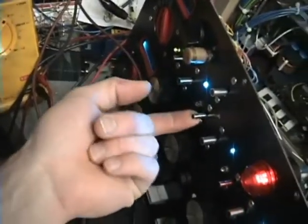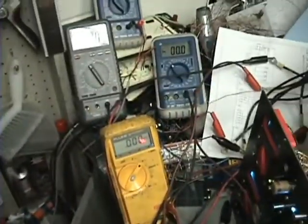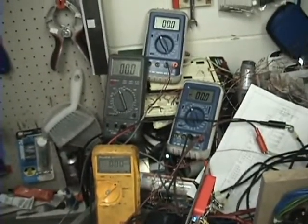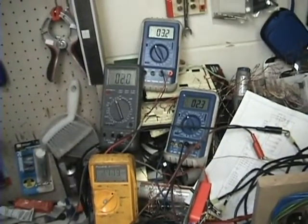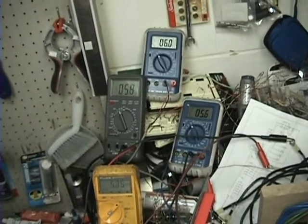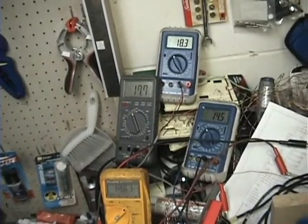Now, remember I told you these switches here connect these together. So now this knob runs all these. Without these, basically they do nothing. No voltage changes, as you can see. So I'm just going to use this one knob, and you can watch what happens to these voltages. They'll all go up at close to the same rate. Again, I'm doing that with one knob because I've internally tied these power supplies, just the control voltages together, all the way up to the top.